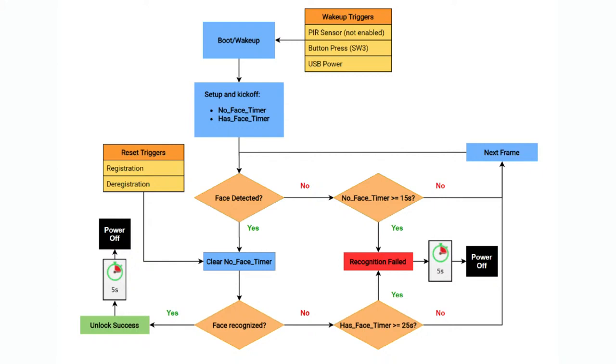So here's the algorithm. It can use deep sleep mode, which I thought was really useful. One of the nice things about microcontrollers — Linux is more powerful, of course, there's face recognition software and OpenCV and all that — but suddenly you're running something that's going to draw about an amp, you need a lot of complex software, booting takes a long time, and there's a chance of file system corruption. What's nice about these standalone microcontroller dev board versions of face recognition is you don't have to worry about your data going to the cloud or somebody hacking into your firmware through a backdoor password. It also can use the built-in PIR sensor — it doesn't start doing face recognition or recording any video until somebody is in front of it. Because the microcontroller can wake up within about 100 milliseconds of the PIR sensor, to a human it's nearly instantaneous.